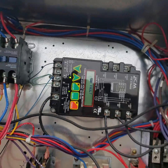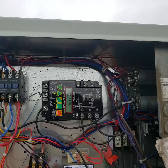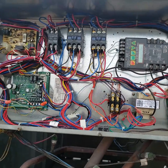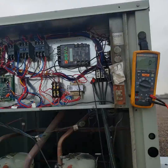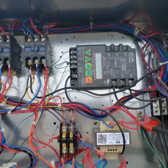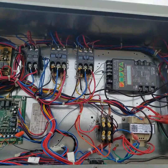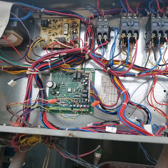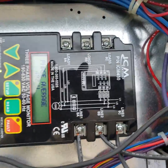Now the fault is clear and we should have power. The fault is clear and the unit should start back up and running normally. It's overcast so it may not even be calling right now. But the phase monitor is clear, so it should be good to go. That's how you clear the ICM 450.